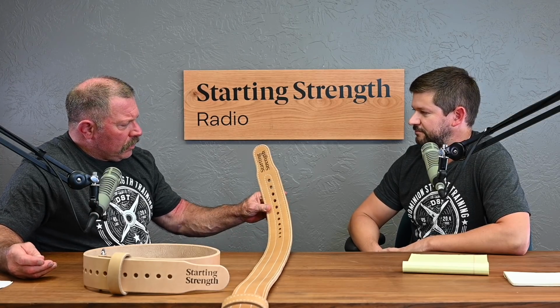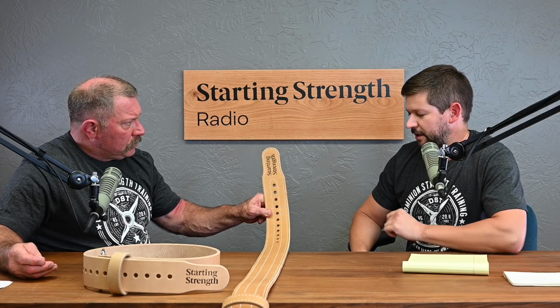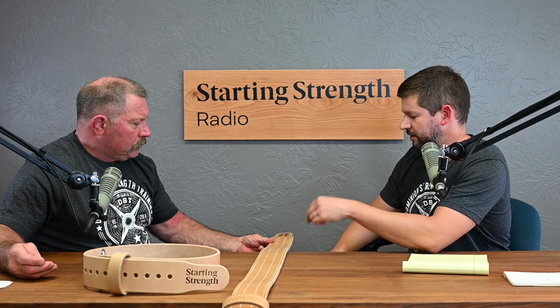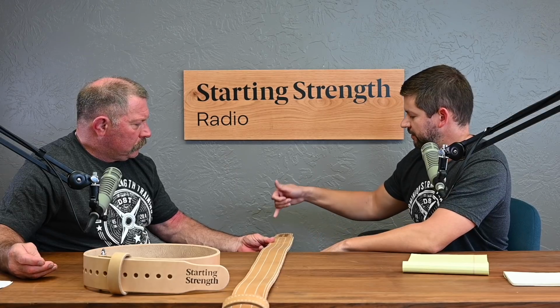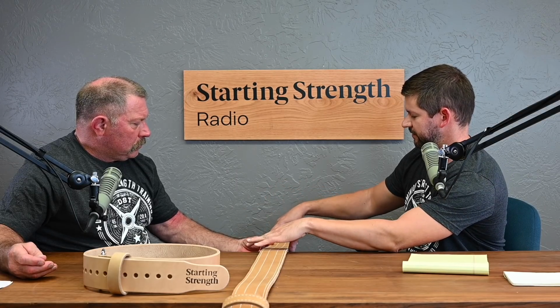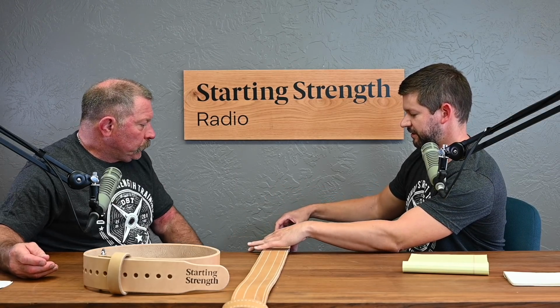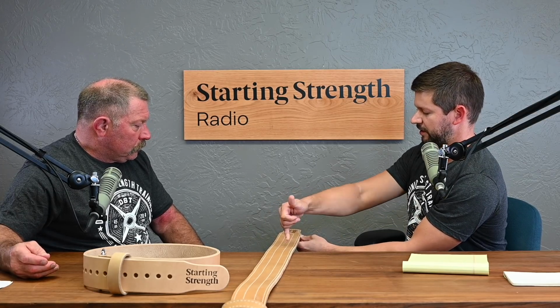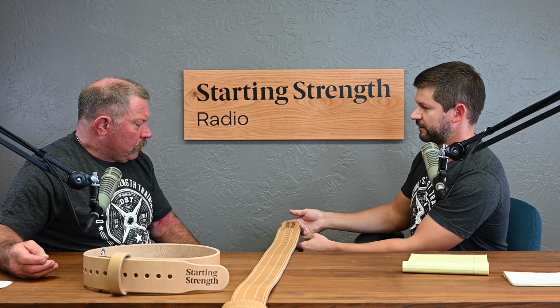And how do you punch the holes? That's a separate die. So for our 3-inch belts, we've got the die that does the buckle end, and we've got the die that does the billet end. So there's a die that sits on here. It's the longest die that our press will accept, but it cuts out this end shape and all 11 holes at the same time. Right. So this is an 11-hole belt.